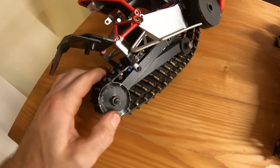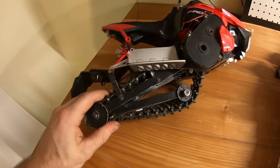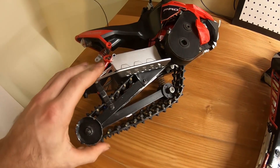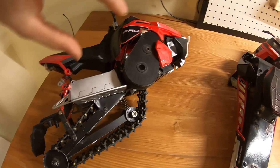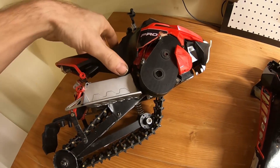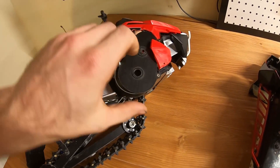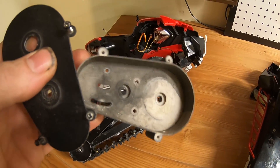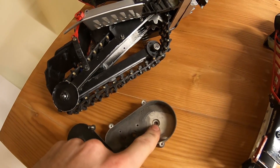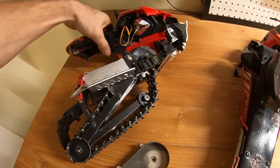The track was from little Tonka bulldozers — we all had one as a child. It was just an aluminum C-channel that was bent to make a suspension, and it works surprisingly well for how rudimentary it was. But I needed a better transmission — I had just tweaked the motor slightly to still use the stock transmission, which wasn't the best solution. So I went and made a gearbox for the very first time. It had three gears — metal gear here, metal gear here, metal gear here, and the bigger tri-axis gear at a bearing. Two metal gears meshing was not the best idea, but it got me where I wanted to go, and it was a great first attempt.